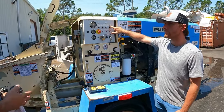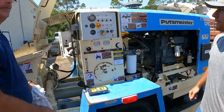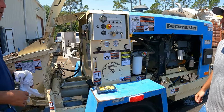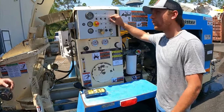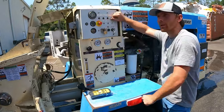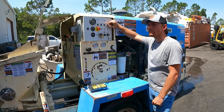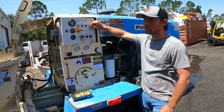This? Your fan. Cooling fan. Okay. So the hydraulic radiator. The cooling fan, I can't hear you, but that's why I always turn it off. But if you're pumping, you're always in a fan. Always. Especially in Georgia, it gets hot. When I'm pumping, leave this on, it don't come on automatically. It will, but like cooking oil, it'll go too late. Yeah, it'll go way past you overheat before that has any effect on it. So go ahead and turn it on as soon as you start. As soon as you start, yeah.